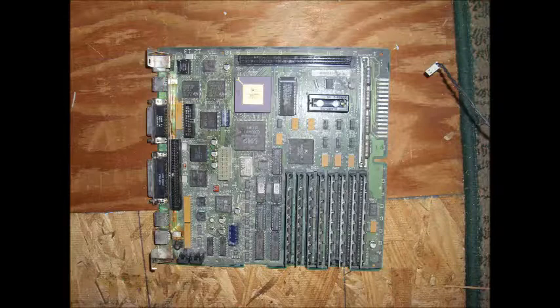I jumped the gun a little taking a picture earlier, but I did remove the battery. That is actually the number one killer of these boards — the batteries do rupture at times, and the battery acid gets on the circuit board and destroys it. I want to say as high as half the boards of this age are affected. If you buy a used SE30 that's been in storage, you could expect 50% of them to have a destroyed motherboard. That's even more so on the Mac SEs versus the SE30s since they're older. I got lucky on this one — nothing's ruptured. It's got eight memory banks, and one of the rare things is it has a socketed CPU. This is the first Mac SE I'll own that actually has the socketed one.